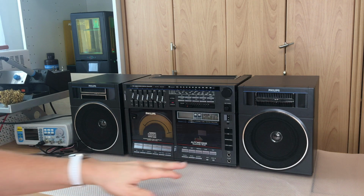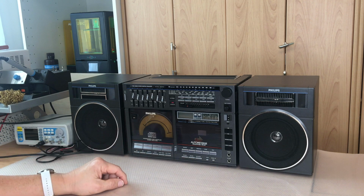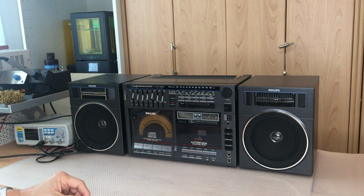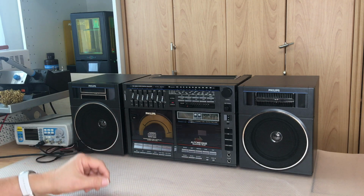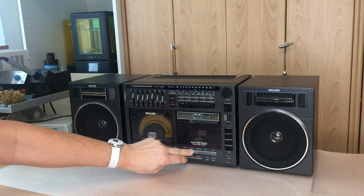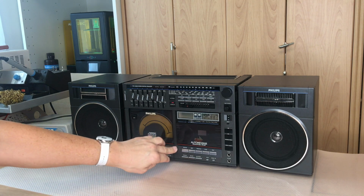But what this also means is that all the keys are not working. Also not the pause, play and stop key of the CD player, because they are controlled by the tape deck CPU because of automatic recording and synchronized recording. So we can click whatever we want. There's no response. Let's click eject.